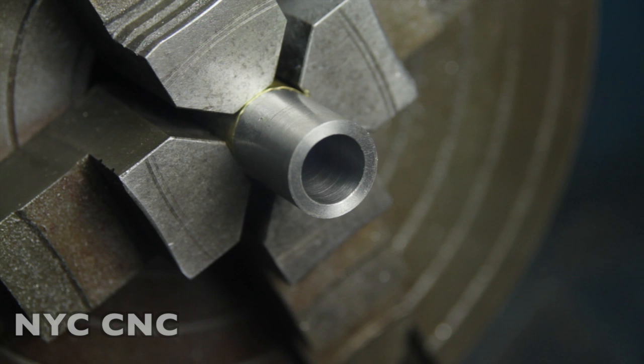So we want to polish this up as best we can. I only had a 499 reamer, so we were stuck with that as a starting point. I'm going to use a flex hone, which I'll show you here in a second, and then perhaps a way of sanding IDs. So we may end up going over 500. I would rather have a better surface finish and then worry less about the ID, but we do at least want to know where we are.